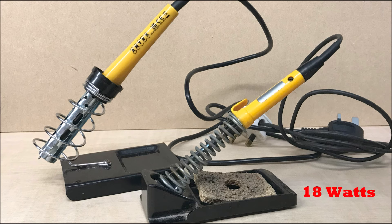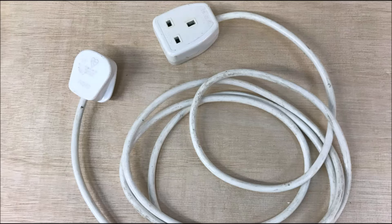The one in front is an 18 watt smaller iron that might struggle for some of the bigger jobs. So if you're going to buy something to get started, a nice 30 watt iron will be fine. Most irons come with some kind of holding station like these spirals with a sponge — if it doesn't, get yourself one. If you haven't got somewhere safe to put your iron and you're balancing or hanging it, it ends up burning holes in things, and if that happens to be you, that's a little uncomfortable. It might also be useful to get a short extension lead of just a couple of meters, because most soldering irons come with quite short leads and you can bet that wherever there's a plug and wherever there's a job to solder won't be within two meters of each other.